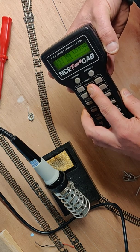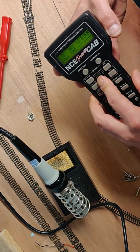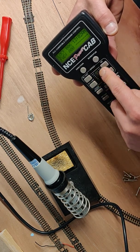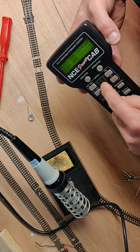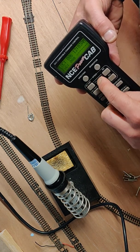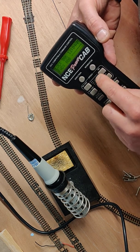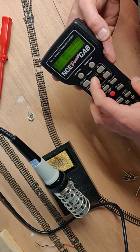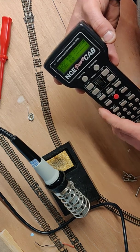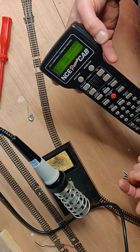The numbers come down quickly when you press the thumb wheel quickly — that's how it should work. What was happening before was I was spinning it and nothing was happening, or it would jump straight to full speed without actually having to push the thumb wheel to get there. A lot of videos online will tell you that you need to change the casing or put a bit of flashing on the casing inside, and that might work for a little bit — I found on this one that pressing the thumb wheel to one side worked a little better, but that's obviously only a temporary fix.